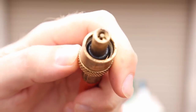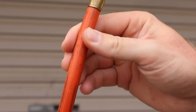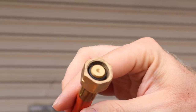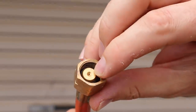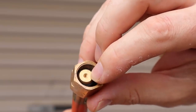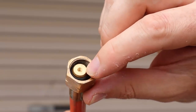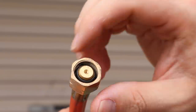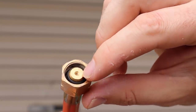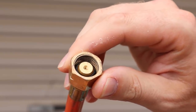I can see cracks in this seal, so we're going to have to change it out. If your entire hose needs replacing and you have to get a new one, just make sure it's got the jet. That there is a primary jet. So keep the old hose and make sure that whatever's in the middle matches, because if you get the wrong sort of hose and you don't have this jet on the new hose, it could completely stuff up your burner and make flame shooters from hell.